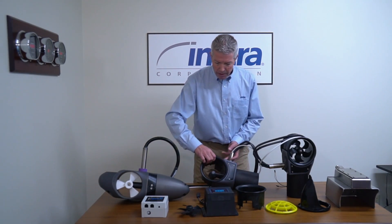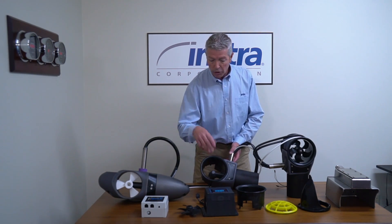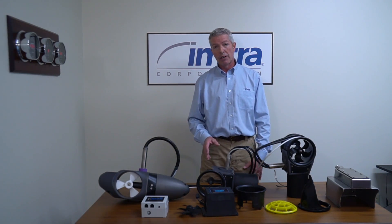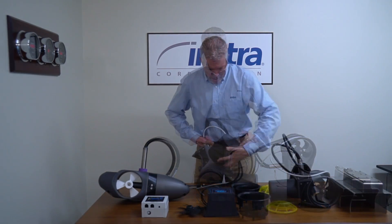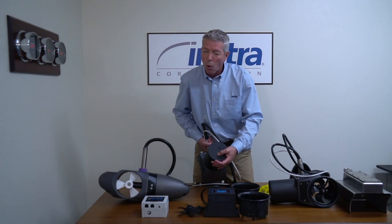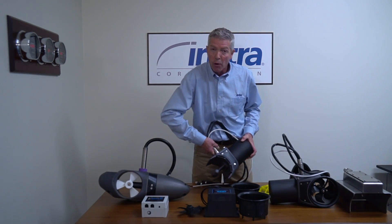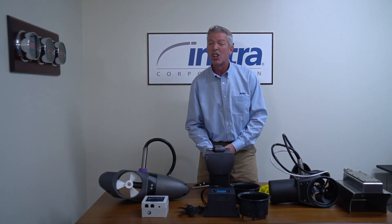This is a 140 millimeter ID tunnel — roughly five and a half inches in diameter — but they have very high water speed in this tunnel. That 50 kilo thruster is pushing almost 10 meters per second. The back of it has holes so it's water-cooled on the motor. It basically has a water jacket: since it's all in the water, you have water around that motor to help keep it cool. So this product has a fairly long run time.